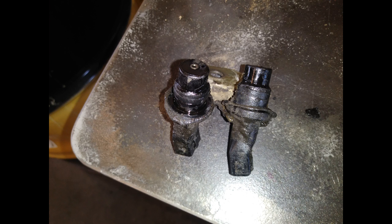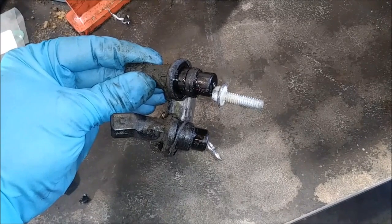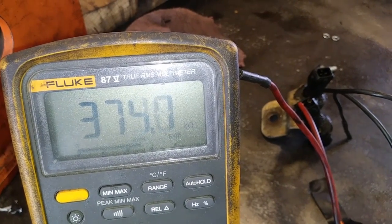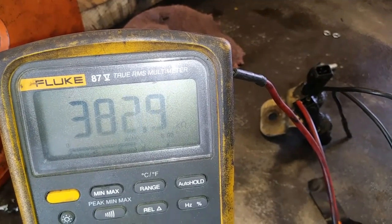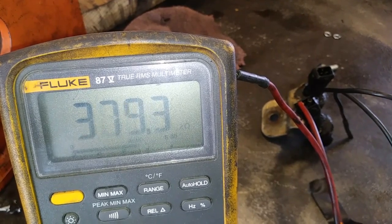I pulled the timing sensors out to ohm them out. They were pretty nasty — not only that, someone had resealed them with silicone instead of replacing the O-rings. Another thing to check on timing sensors is that the tips are magnetic and can pick up metal debris, gear teeth, loose fasteners, and metal shavings, which can throw off your readings. The primary timing sensor on this 3126 has to be between 75 and 150 ohms — this one was about 124 ohms, so it measured correctly. The secondary is supposed to be between 600 and 1800 ohms, but this one was too low — less than 600 — and the sensor was not reading statically. Either of those issues would require replacement, so we changed them out and tried to start the engine. It fired up the first time.